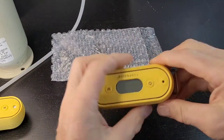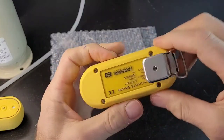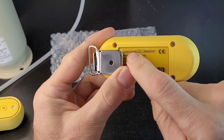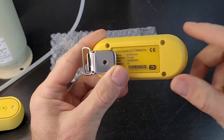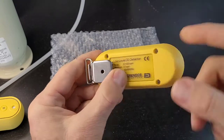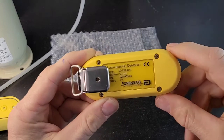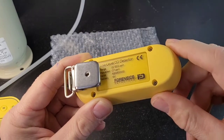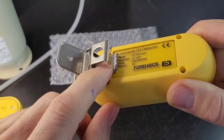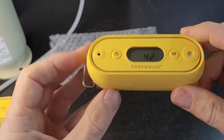What I want you to do first is just turn it on. As it counts down — it has a 60-second countdown — make sure the serial number matches the calibration certificate, and confirm it is indeed a low-level carbon monoxide detector as you purchased. Note there are four hex screws on the back — pop those off if you ever want to change the battery; it takes a nine-volt. There's also an alligator clip and a stainless steel belt clip — if you don't like it, unscrew it and it comes right off.